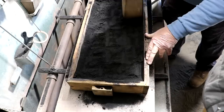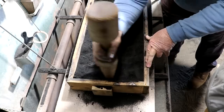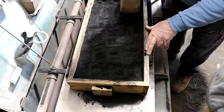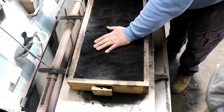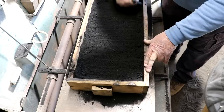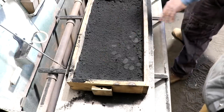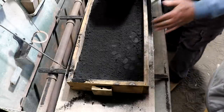Right now he's just packing the sand down up against that mold. Because of the temperature today, the water amount I've got in the sand is a little less. With that said, I'm trying to make sure we don't have any crumbling effects as we go. Different temperatures out here require different amounts of water. What I did just now is just kind of score the sand so it doesn't laminate — it's disappointing when you make a mold, pick it up, and then half of it falls out on you in one big sheet.